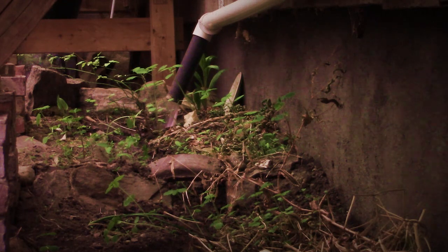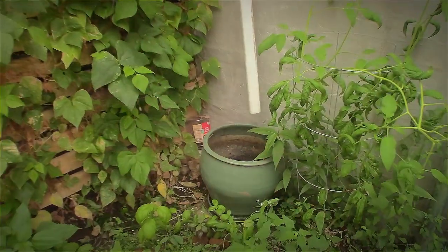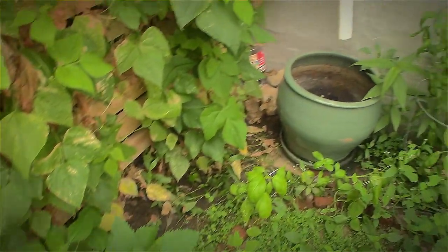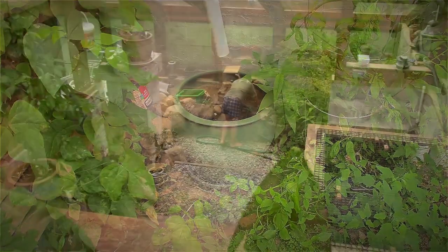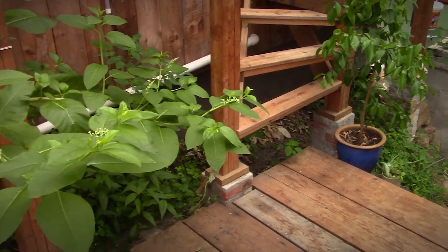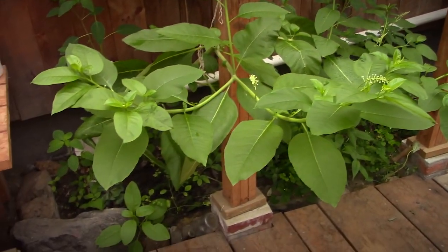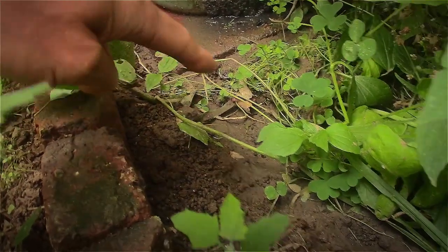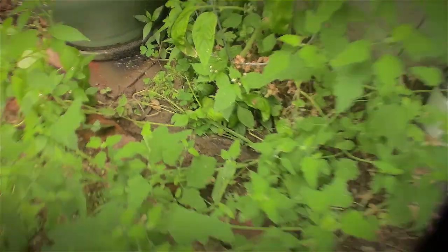In the past I ran gray water from my kitchen sink at my last homestead, and my experience has taught me that not all gray water is made equal. The gray water that comes out of the bathroom is awfully clean. Because of that, I found that this little groove that goes along the edge has remained relatively open, free, and porous — that was not the case when I was using kitchen sink water. When you're washing dishes, there's oils going down, bits of food, and all those bits tend to plug up the soil and create little shoots.